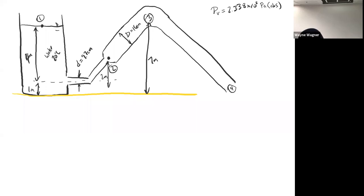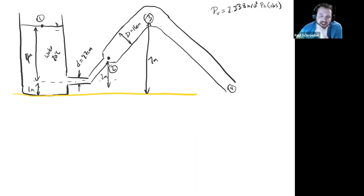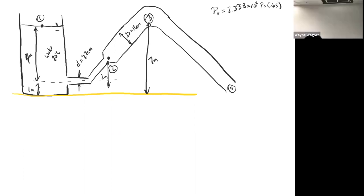so this is going to be a bit more of a dialogue than just me working it. Cavitation, what do you remember about cavitation? Most of my students won't remember a whole lot at this point because we only talk about it very briefly and then come back. Yeah, I don't remember the definition too well. I know it has to do with flows in pipes and when it's at the wrong pressure. Yeah, so if the pressure drops too low, there's not enough pressure to maintain the liquid as a fluid, and it basically becomes a gas.